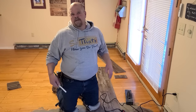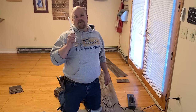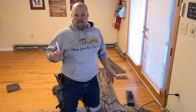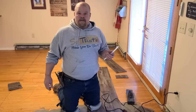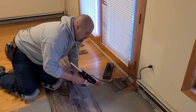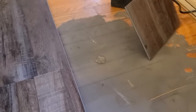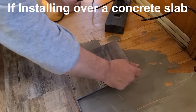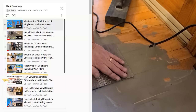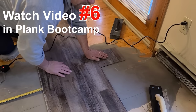For those of you on concrete: you can use these special glue sticks — not the kind from Menards, Home Depot, or craft stores, but a special glue designed to stick to concrete. Take the glue gun and give yourself a Hershey kiss-sized amount. Then lock in your scrap piece like normal and set it right down into that glue. Make sure your measurements are good and then wait — it takes about five minutes for the glue to get hard before you work off of it.